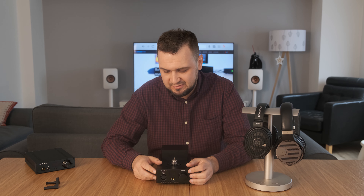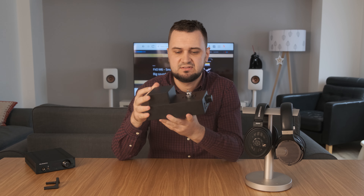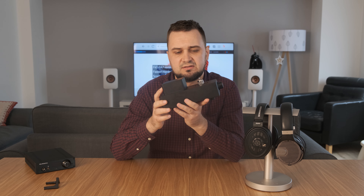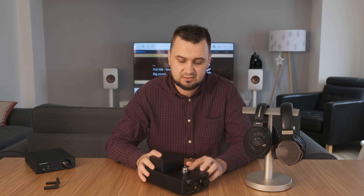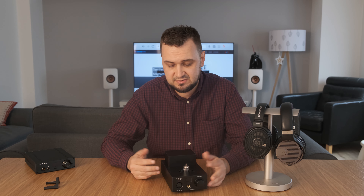Let's take a closer look at what's inside. I tried opening it up with my usual tools, but unfortunately the motherboard is soldered to the transformer right here, so I took only a small peek inside. I've seen audio-grade caps such as Nichicon and Elna Silmic, also X-Duo's two polypropylene film caps. I've seen a single DAC chip — it's the famous AKM4490 that is used nowadays basically everywhere. It also has a few transistors for input and a single tube for the output.